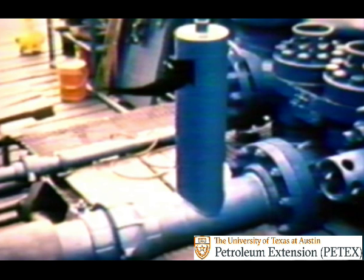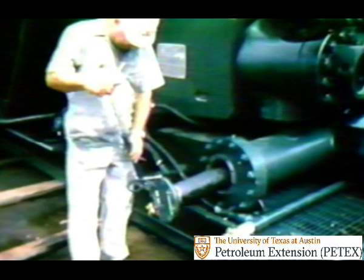But if the lines are clear and nothing appears to have collapsed, you may need to add a dampener to your suction system. This is especially true if you have a small diameter suction line or a line which is a little too long. This dampener works as a miniature version of the elevated mud tank—it keeps pressure on the suction line and keeps the line full of mud. Built-in suction dampeners are also available; this flexible rubber dampener is filled with ten pounds of pressure and inserted into the suction manifold, absorbing any surges in pressure from the incoming mud.